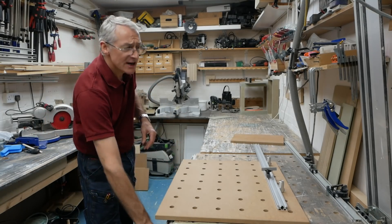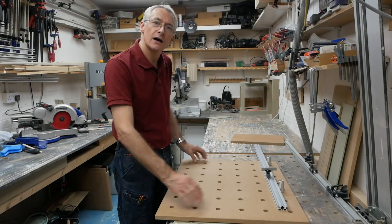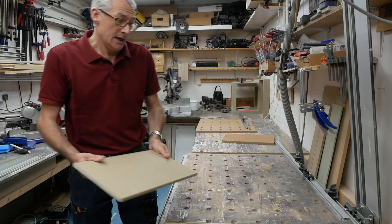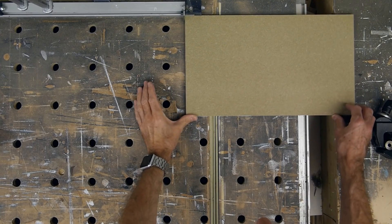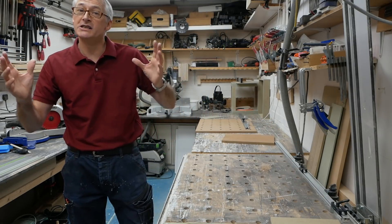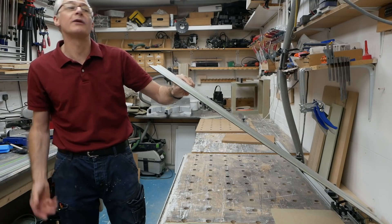I'm going to demonstrate how to do narrow cuts on my MFT as it's just a little bit easier for me. So if you're new to the MFT or MFT style system, you might be wondering what the problem is. Well, the problem is actually twofold. First of all, because the fence has to fall short of the rail splinter guard — obviously you don't want to be cutting through the fence every time — there isn't that much support for the actual workpiece on a narrow cut. The second problem is if you want to make repetitive cuts and use a stop, especially when your cut is narrower than the rail itself: fairly obviously, the stop is going to get in the way of the rail when you try to either drop it down or put it in place.